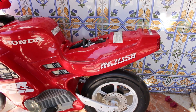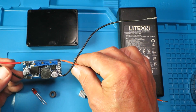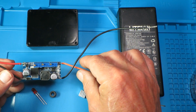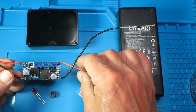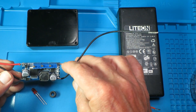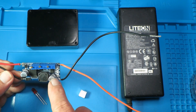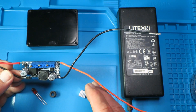So the other thing we're going to need for our motorbike project is a charger. Now I've used these modules before and I'll put a link in the description — these make a very good battery charger for the sealed lead acid types. We can set constant current and we can set the voltage, and it also gives us a charge indication.